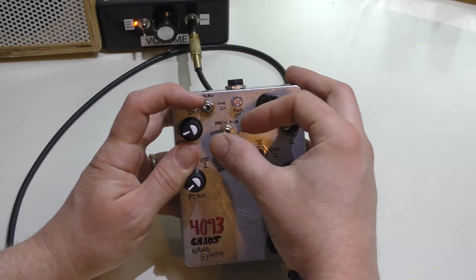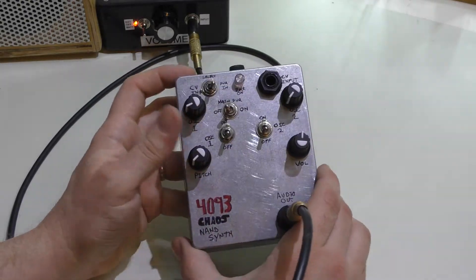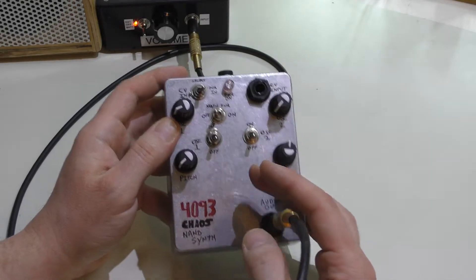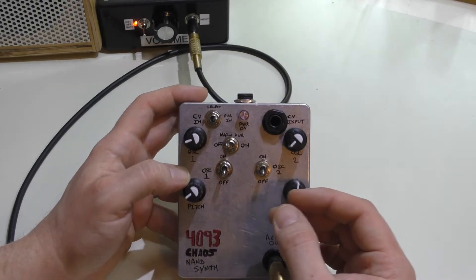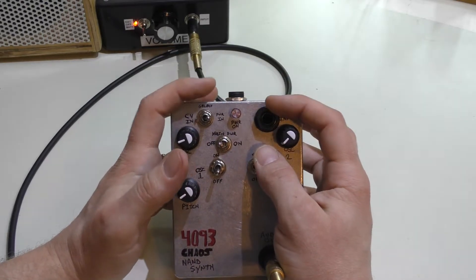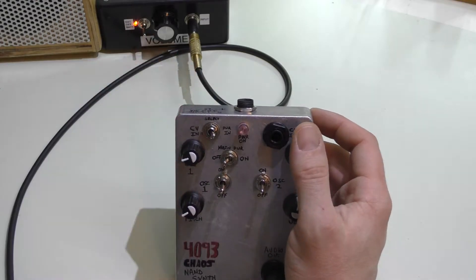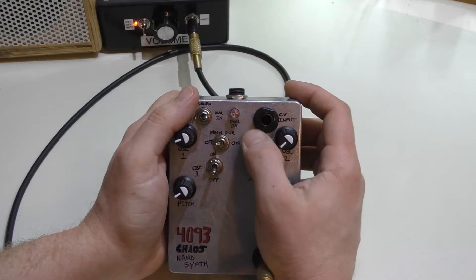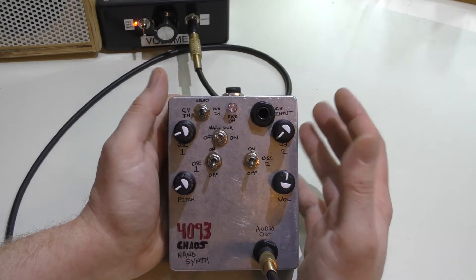You can see there's a little LED at the top over here which kind of fades out with that same effect. Now this kit is actually a little bit open source — you can go inside and tweak it to your own liking. There is a breadboard section inside here that you can add your own circuitry to. One of the things this came with was a CV input mod with the switch, which works off of the DC jack. Another mod I remember seeing on their website was a button you can use to do the dive bomb effect instead of shutting it off, but that's just something you can add in later.